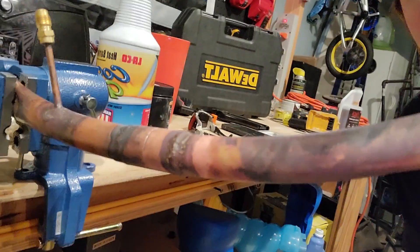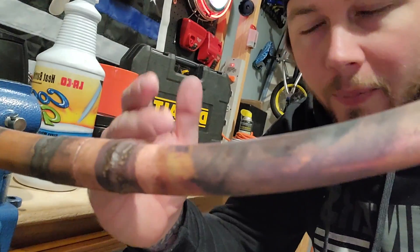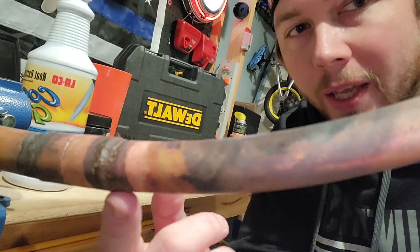The cool gel is also the hardest to work with. If you try and wrap the pipe with the cool gel, when you get it on the top it'll sit, but when you try and get it on the bottom it's going to constantly try and just drip off — and that's a huge pain. So I'm going to leave a link in the description as to where to get these two products. You can probably find them at your supply house, but at least on the internet, I got you covered.